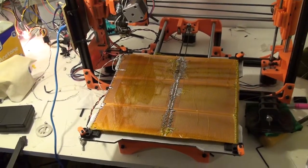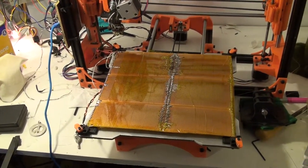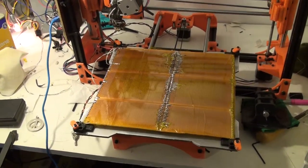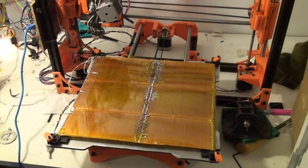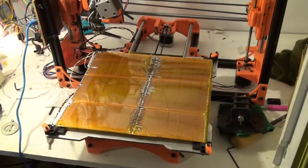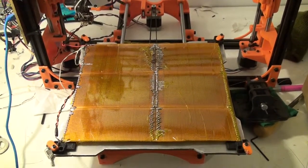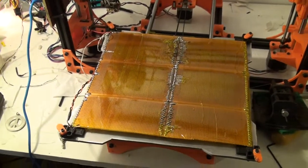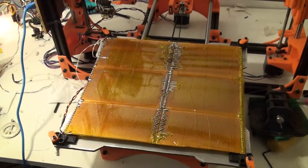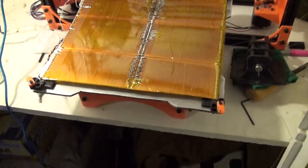In this video I want to talk about the stripboard heater and note some of the experiences I've had with it, for anyone considering building a stripboard heater this large in this style. I'll start by talking about the main problem I've had with it, which is that sometimes the traces or the joint in the middle will desolder itself from the rest of the trace.